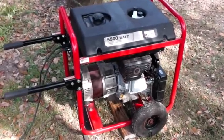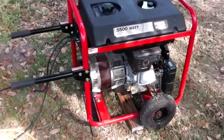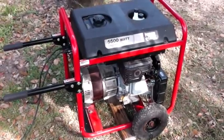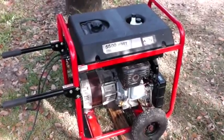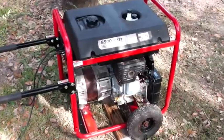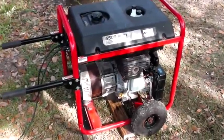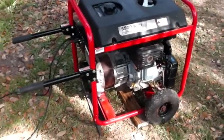It's just something you have to ask yourself. A lot of people want a generator just big enough to run their central air conditioner because they want to be cool and have their comforts in a grid-down scenario. On a smaller central AC system you need about a 12 kW generator; for a larger system you might want 15 kW. People argue that their AC doesn't pull that load while running — and that's true — but air conditioners start up at six times the load. You have to have something to compensate, and that requires a larger generator.